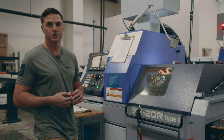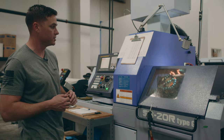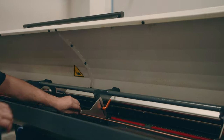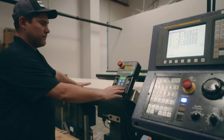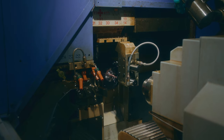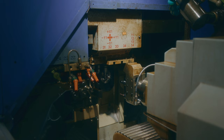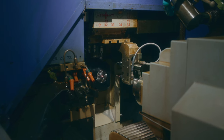Here at Guerrilla we also manufacture our own solid copper turn projectiles. We have three Swiss screw machines that feed in solid copper bar stock, with drills and saws that cut the geometries into the projectile. Based on the type of copper and geometries we're putting on them, we can get them to function differently — whether we're manufacturing a fragmenting projectile or an expanding one. We produce a multitude of calibers in-house, everything from .338, .300 Blackout, .308, .243, .22-250, and even pistol calibers like .380 and 9mm.